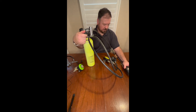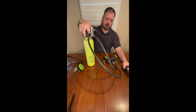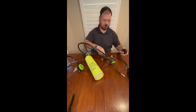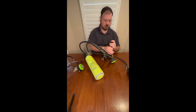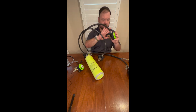The piston hit kind of hard, it sounds like. All the way open, quarter turn back — another thing I don't see new divers do enough of. This one should run a little lower pressure; being a piston, 125-ish, on the money — right where this one should be.